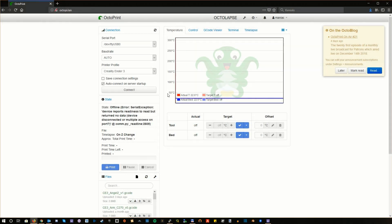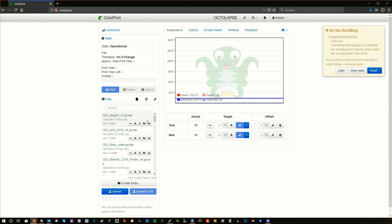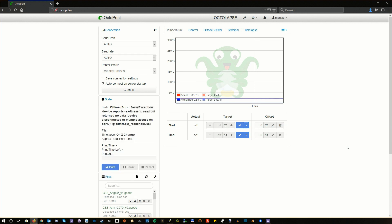After installing the plugin, there's one more thing you need to do. You have to change the port from whatever USB port it was to automatic. You might need to disconnect and reconnect your printer, like I did. After this, you are ready to test. Turn off your printer, but make sure the Raspberry Pi is still powered. You will see that Octoprint marks the printer as offline. Now turn it back again — it might take about 20 seconds for Octoprint to realize the printer is back online, but it will eventually happen.